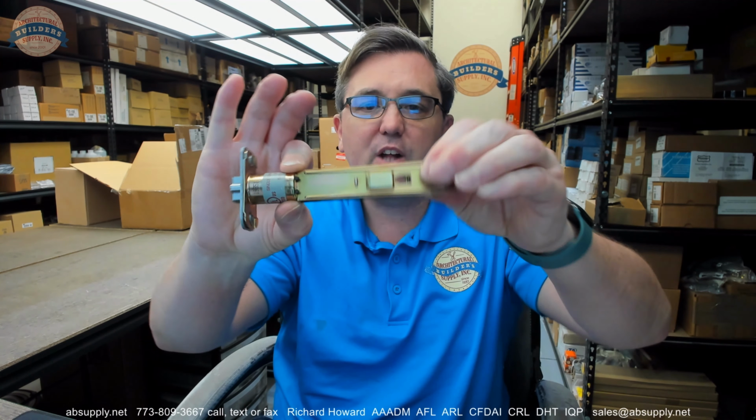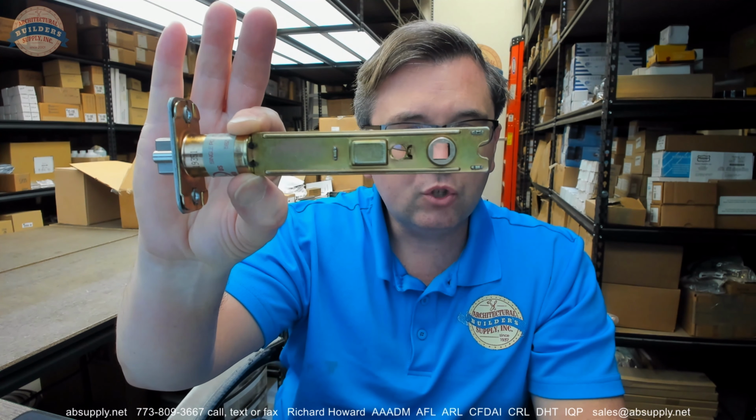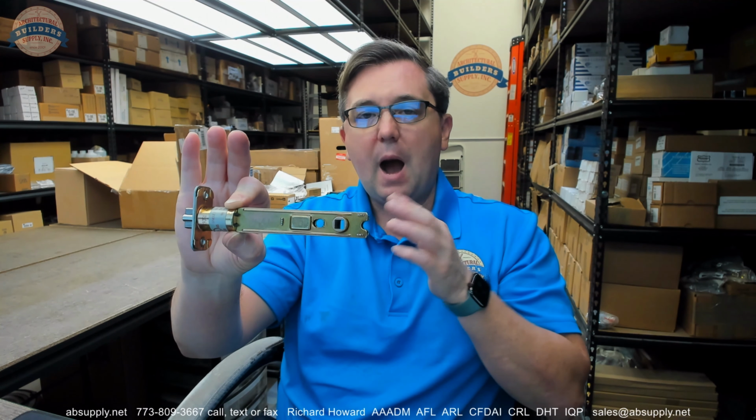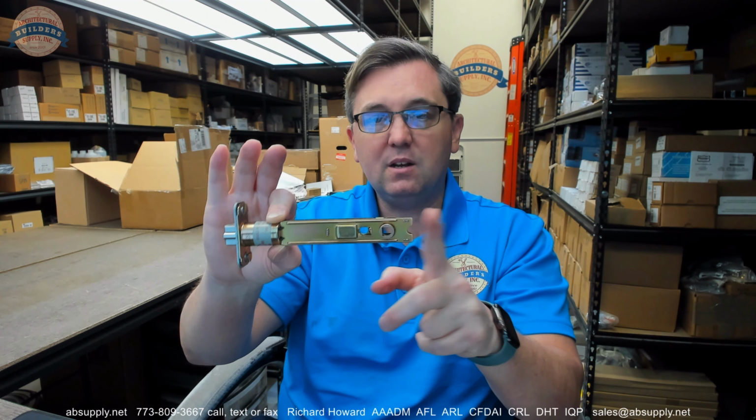So this is obviously a tubular style, and I say that because the construction of the latch bolt is, of course, compatible with what would be called tubular, where the operating spindle of the lock actually runs through the latch bolt rather than engaging the end of the latch bolt like you'd see in a cylindrical lock. So a tubular lock. This is the 3938, and that means a 5-inch backset. The RC means radiused corner. Those corners are radiused. That's a 1/4-inch radius. That would be typical and common when you are mortising a door with a 1/2-inch router bit and you don't square the corners like many door pre-hanging shops will leave it at.